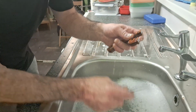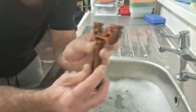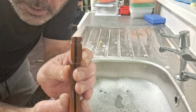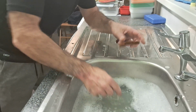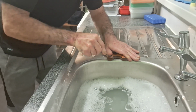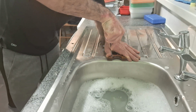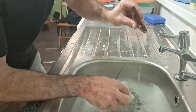The other thing with doing this wet is the water just washes the dust straight out. You can see that cut now is starting to go back around the curve and it's going to come round and meet the other one. They'll barely touch, but that's what it's going to end up like. And same again, as we're going this way, start to take the cut back round into the frame using the tip of the file, because I want it to go into a point in the middle.